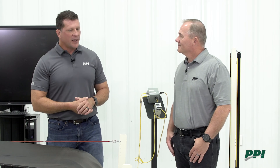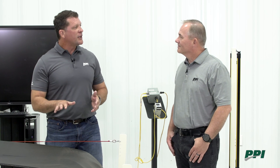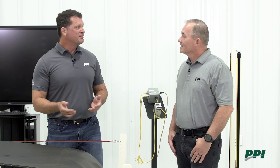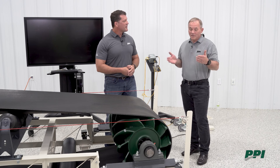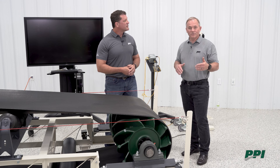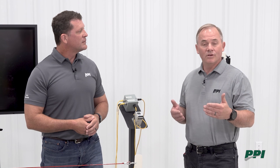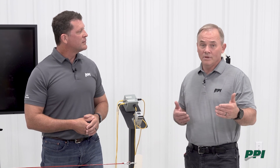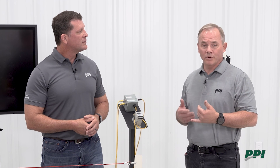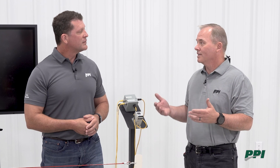One question customers may have is why go to all the trouble of loosening and skewing idlers instead of just turning those take-up frames. What they don't realize is that by moving those idlers they're not inducing any extra load or force into the conveying system. That's absolutely right — the key reason not to use screw take-up frames to adjust belt tracking is precisely that it changes the load on your bearings and conveyor pulley. If you increase the load high enough, it leads to premature bearing failures, bushing problems, pulleys walking on the shaft — a host of issues you'd rather not deal with.